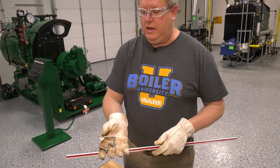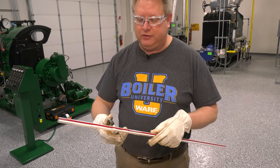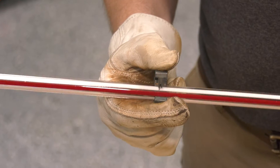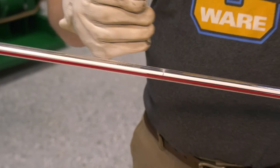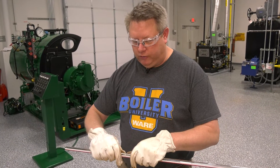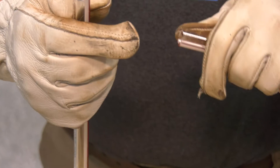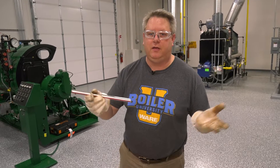This is the cutting tool that we like. There are chain types, but I just have the best luck with this. Cutting glass is really about confidence and not over-scoring the glass. We want to do a minimum score at our mark — basically scratch or etch about a quarter-inch mark in the side of the glass. If you over-score the glass and try to go all the way around, you're actually more likely to break it when you snap the glass. To snap the glass, you put your thumbs opposite the score mark and just do a quick, confident snap. Once I've cut this, I'll check the fit before putting the gaskets on to make sure I measured correctly.